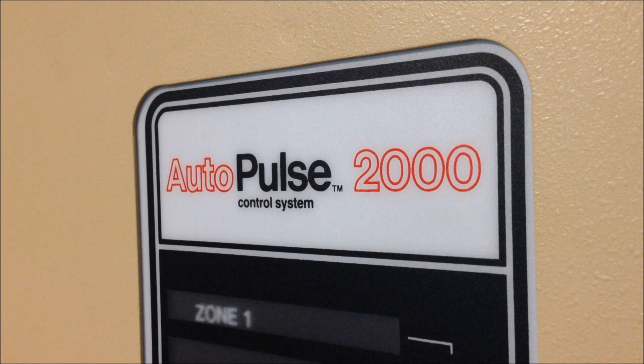So that's all the system test content I have planned for today, thank you guys for watching. With the short mention of the Halon system while resetting the DMP keypad, I want to give you guys a little preview and heads up about the next system test. This whole board — including the SX-LEX, the DMP system, and the Halon system — are all wired together as the same system. Most of my system tests focus on the SX-LEX side, and a lot of times the Halon system portion doesn't even make it into the video. The last time it played a major part was system test 18, where I activated the Halon system.